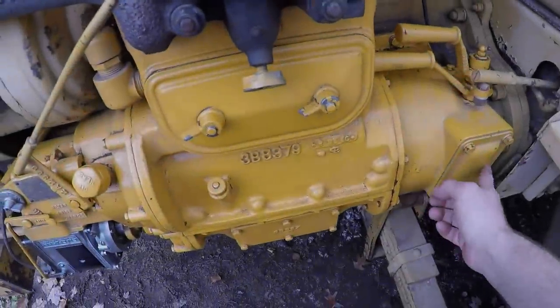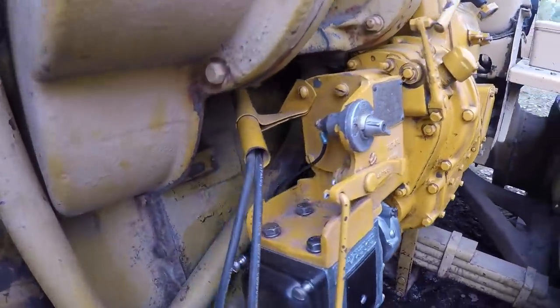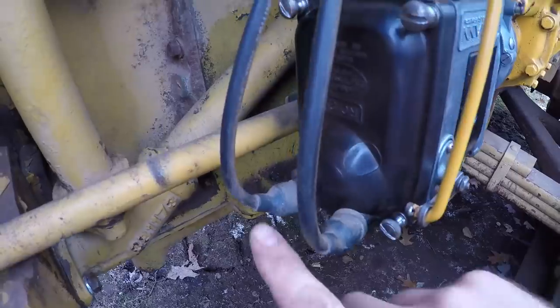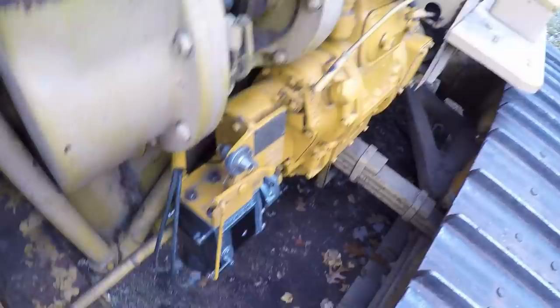While I was replacing covers off camera, this was such a simple disassembly that I just reinstalled the mag switch wire, got the spark advance linkage hooked back up, and put the plug wires back on. Pretty simple install here, didn't think you needed to see all that. It's all back together — I think it's time to test it out.